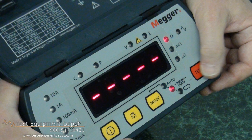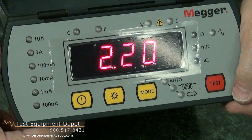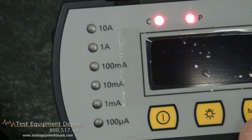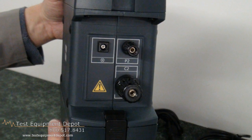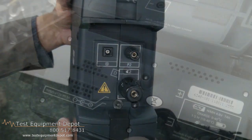This gives accurate results in under three seconds. It has a four and a half digit seven segment LED for easy reading. It features auto current reversal to cancel the standing EMF effects. It has a 250 milliwatt power limit with optional override to avoid heating the test sample.